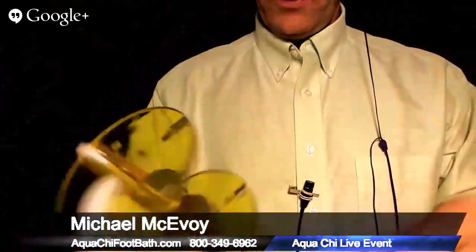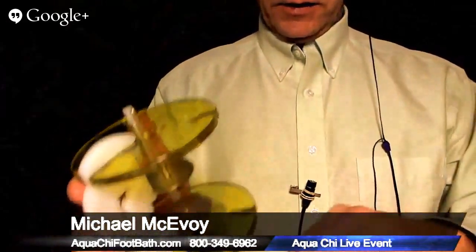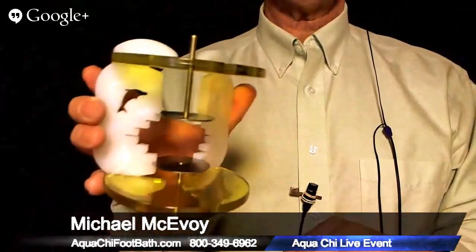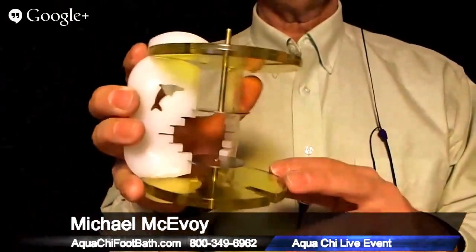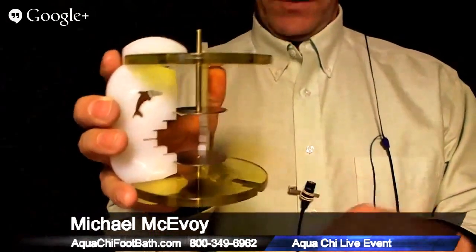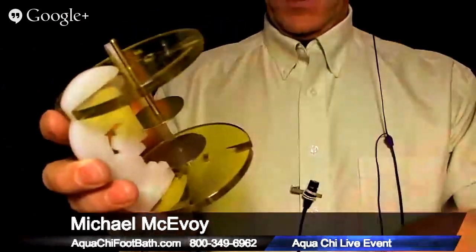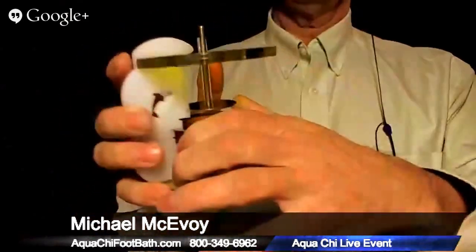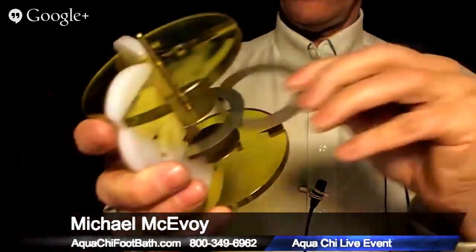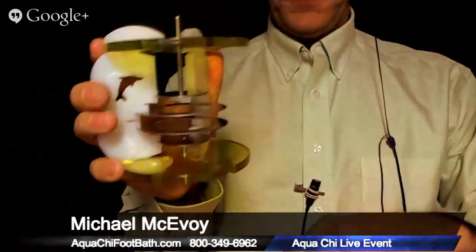Now putting the module back together is nice and easy. So we've done two things by doing it this way. One, there's no confusion about which leg goes back where, because you only have taken one out entirely. To put it back together, you're going to put the large silver rings in first, one on either side of that center copper ring. Okay, the copper ring's going to go in between these two. Put that back.